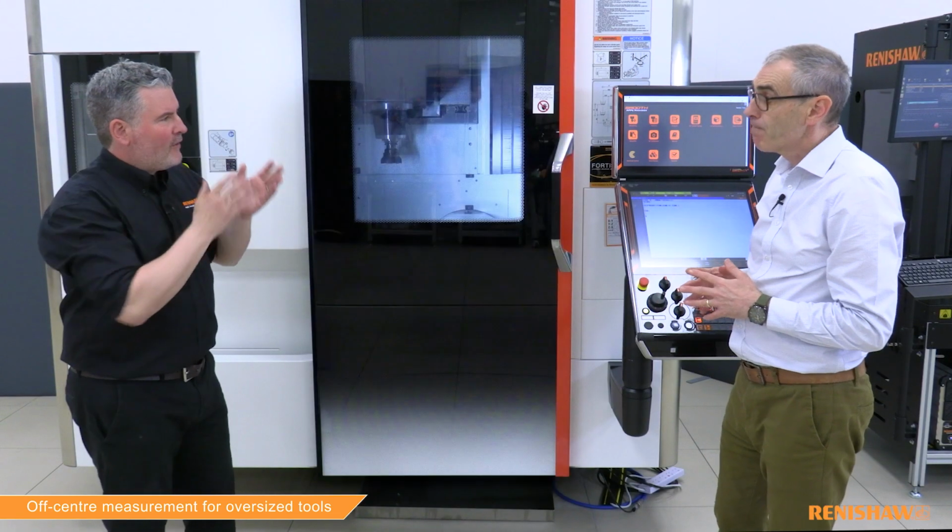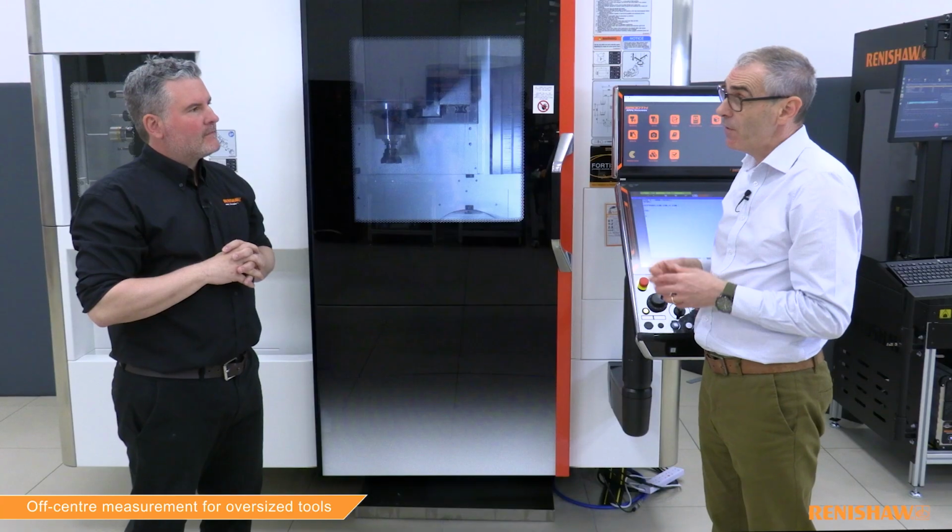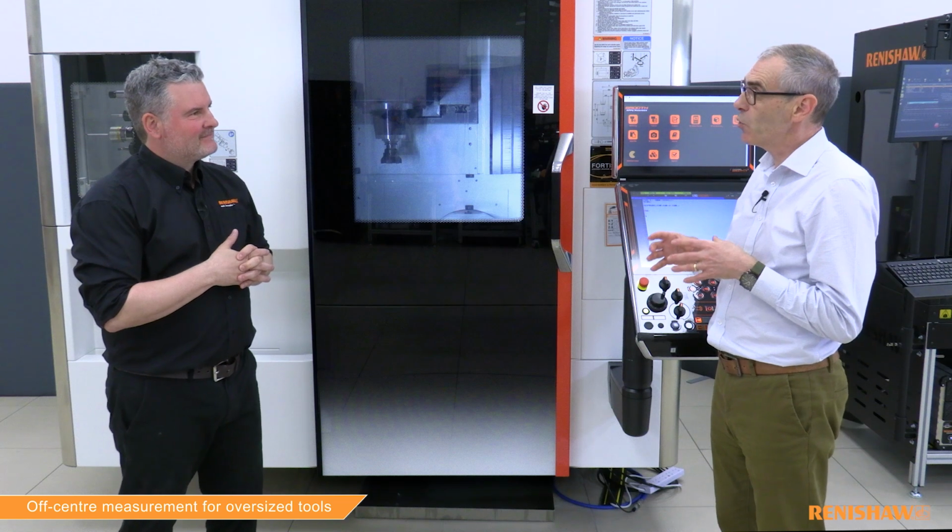All right, the tool's been measured, the offsets have been updated, but can we set tolerances just like our 9862 cycle? Yes, like our 9862 cycle, we can set tolerances for both length and diameter with the H and the E inputs, and we've covered these in previous videos. Okay, so before finishing today, I believe there's one last thing about this cycle that our viewers might find interesting. Yes, although we've designed this cycle for large diameter tools, it can also be used for standard tools if you're looking to save measurement cycle time. The cycle time is saved because the initial long tool, short tool search is omitted, but of course you must remember to enter a nominal tool length value.